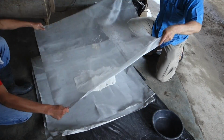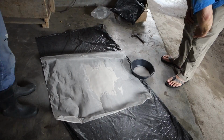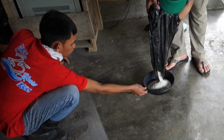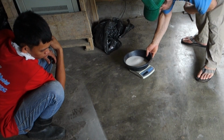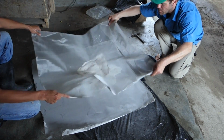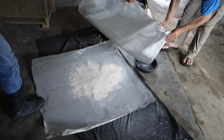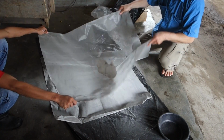The tailings of the liberation test can be used to determine the grain size that produces optimal liberation. The sieve test begins by drying and weighing a large sample of liberation test tailings. Samples of these dried tailings are then passed through a series of sieves, starting with the sieve that has the largest mesh size. The amount of ore caught by each sieve is weighed at each step.